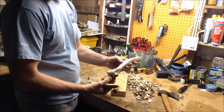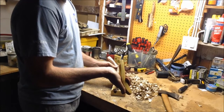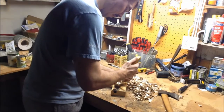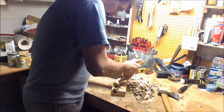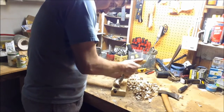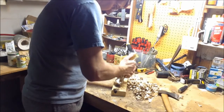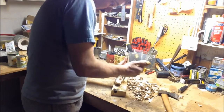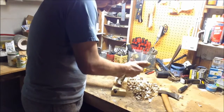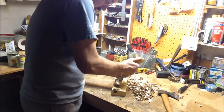So we've got the bowl sort of roughed out and I'm just working on the gouge now — using the curved end of the crooked knife and making some progress. I thought I'd film this momentarily so you can see how the curve, or the hook on the end of the blade, works. This would be a lot easier with a softer wood. This is maple that's been seasoned probably for over a year, maybe two years now. So it requires a lot of effort.